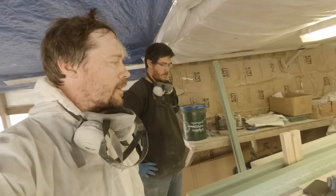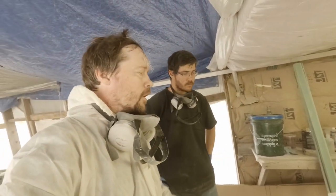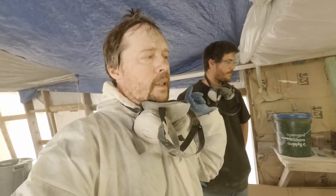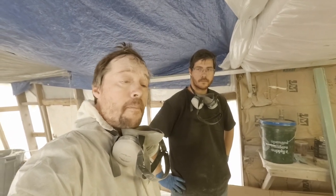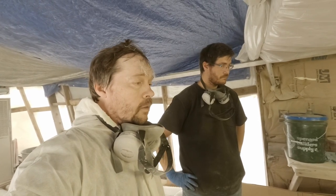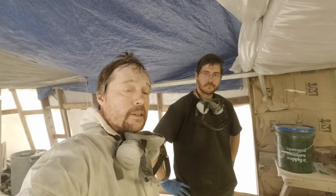We're pretty confident that we won't have any problems with these bulkheads without this, but like I say, this is serving two purposes. We have to have something to hold our bin boards in. The only other alternative is to take aluminum channel and bolt it in there. Then we're putting penetrations through our nice foam core and we want to avoid that. And we're also going to beef up the structure, so there's absolutely no doubt in my mind or any worry in our mind that it's going to be strong and secure.